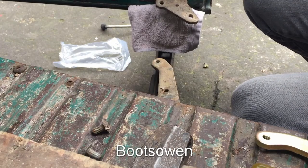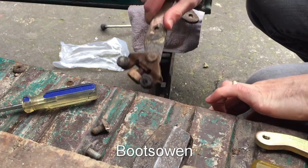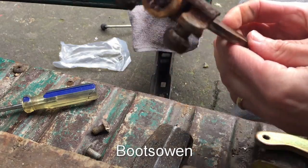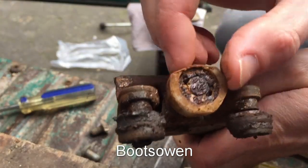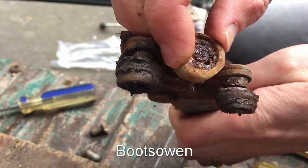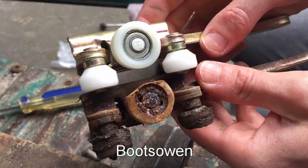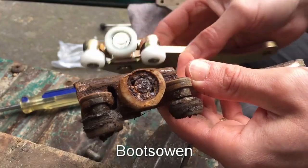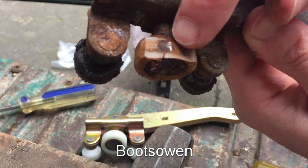The door's falling off at the top because I didn't have it properly held on. So let's get this thing out and have a look at it. Oh yeah, that's your problem there — that pulley's just dead. The bearings on that, it looks like it's been swimming in something. There's no question that was the problem. The bearing doesn't even go around, so it was just wearing off the nylon and it had gotten down to the metal. That's the ball bearing inside there.